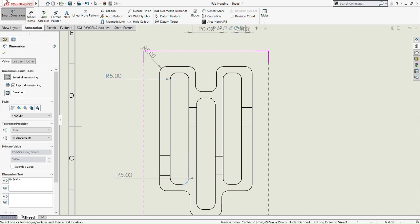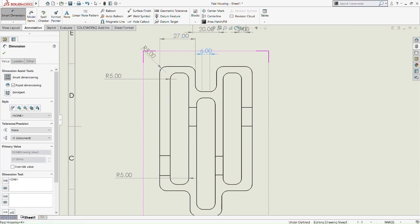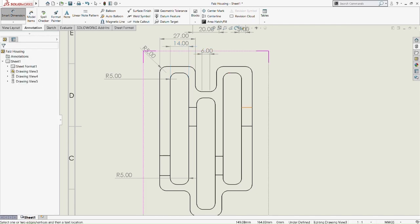So this one is 6mm of the side, where the part where it goes to fillet transformation, and then from this we take the overall width, the width of the first rectangular part for where we insert our gear, 27mm and the 14mm on the first rectangle. So this one is 50mm in diameter, where we house the shaft, and this one is 8mm in diameter for the casing.